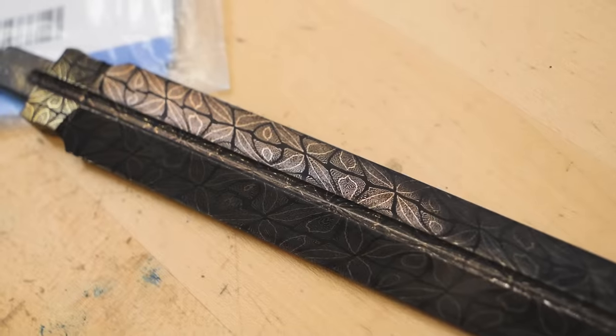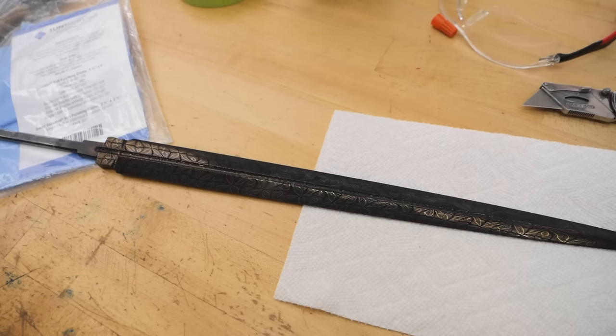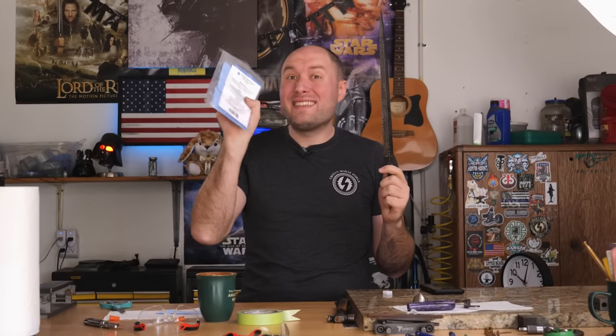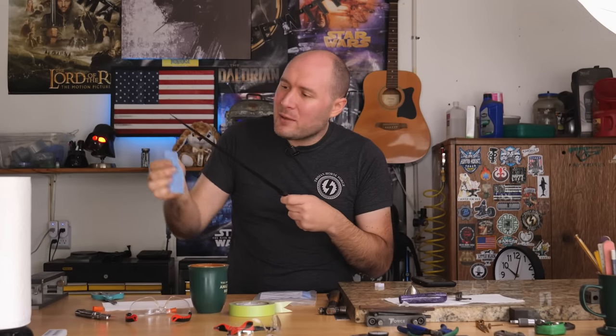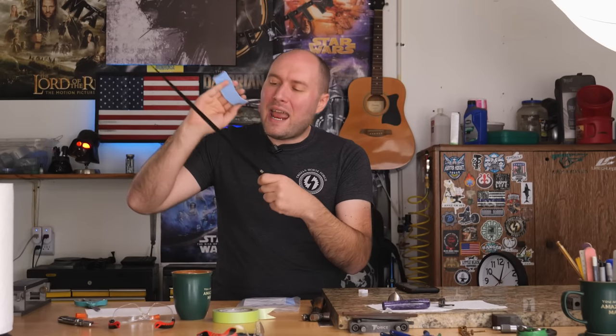It's the next day. I let the blade stay in the coffee mixture for six hours. The next thing I'm going to do is get rid of all this yellow and dark tint that's kind of all over the blade, especially the 15N20 — it's really discolored with this yellow and kind of black weird stuff on it. My secret weapon for this is sunshine cloth. This is made for the jewelry polishing industry — cloths with some really, really fine micro abrasives — and I'm going to gently go over the entire blade and try to shine up the 15N20, get it looking nice and silver again, and hopefully not rub away all the dark 1084.